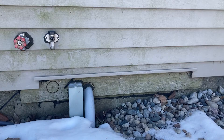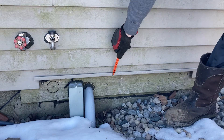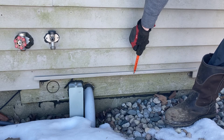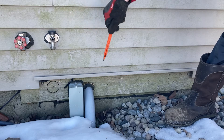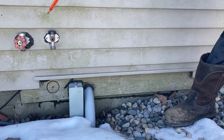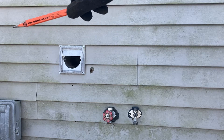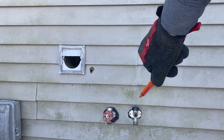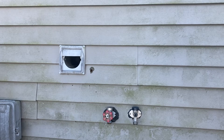A couple of things to take note of. You'll see right here is a piece of wood that somebody screwed into the brick — I want to miss that because I don't really feel like drilling through the brick. These are water faucets; one of them's hard water and one of them's soft water. I know these go through the actual wood, so somewhere the brick turns to wood. I know these go through the actual wood because I've been behind the house. So I know between those two spigots and the dryer vent is the floor, because the dryer vent comes out on top and the spigots are in the crawl space still. I want to drill my hole in the wood in the crawl space — about 12 inches or whatever I have — so I don't have to run the wire up and through the drywall; I can just run it straight out.